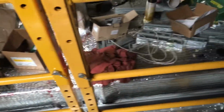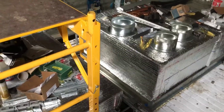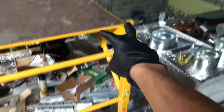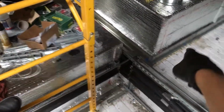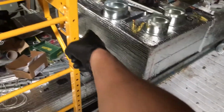And then we have extra piping for the rooms that are going to be pressurized, and they're going to have a purge feature on them, where going up on the roof we're going to have a HEPA filter with the blower motor built integrally with a VFD on it, and it's going to come down and feed into both of our filter boxes right here. As you can see, the filters go like 7 feet across and 5 feet deep.